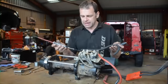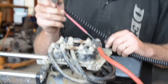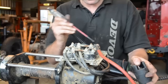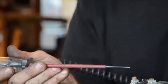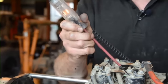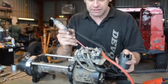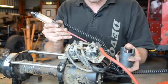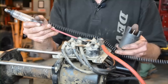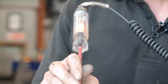All you need to do that is just a standard, straightforward test lamp. We put our earth on the battery, and then we test if we've got power there, which we have. To do this, you click the switch over and then test the solenoids. I know because this is a WARN, the green wire means going in, so I go to that one immediately. That solenoid is getting life from my control switch — there's the power. My next test: when I activate this solenoid, there should be power coming here. I activate it and there we go — that solenoid is good.